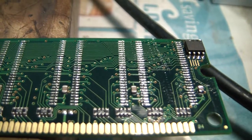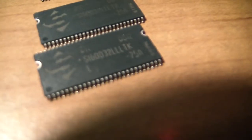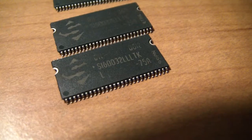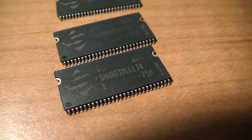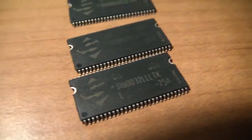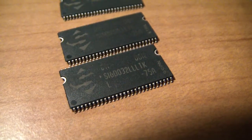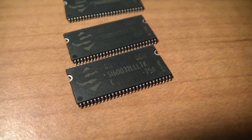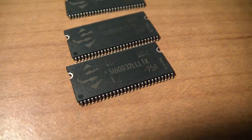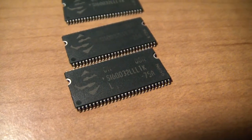I'm going to try to place the chips onto the PCB board just like that, because when you remove the solder you need to apply the right amount of it. What was happening to me a lot in the past is that the pins of the chips would get shorted with solder if I had too much on there. There's just the right amount of solder there right now — that's why I don't want to go through the process of cleaning the pads from the old solder and applying new solder, because it's a tricky process to apply just the right amount.